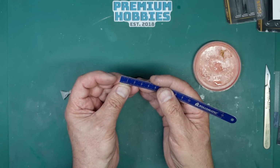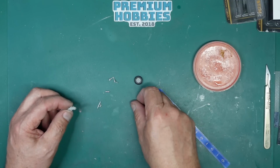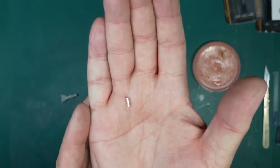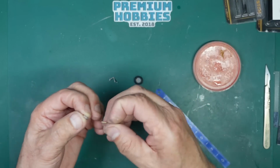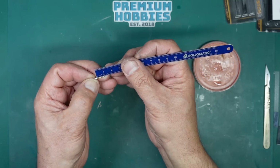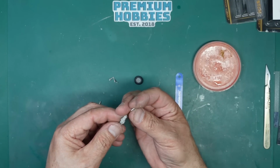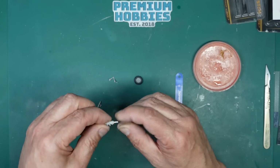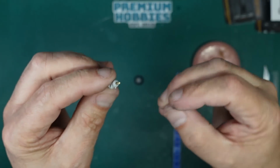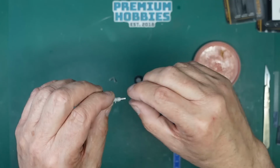You can work out then, because I can see that this is about 14 millimeters. I know that that hole is about 11 mil deep. So we'll call it 10.5 mil deep, a little bit of clearance at the bottom. So I know now that if I put this in here, this is my little aluminium shaft I've turned up. It's just basically a piece of aluminium with a 1.3 mil hole in it. So I can push that in there, and I know that I need to cut that off to about 10 millimeters. You can see there, it's just short of 10 millimeters. So I know then that it'll assemble, it'll all go together and nothing's going to foul, because I want that piece of aluminium to go just up inside. You can see there's a bore in there around that brass. I want that to go up inside there so it forms a lovely joint just like the real thing. And you get a real sharp joint, get a wash in there, it'll look amazing.